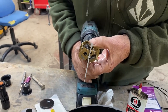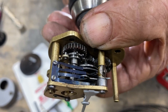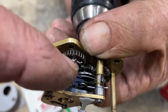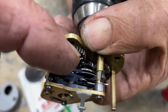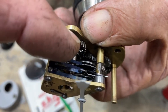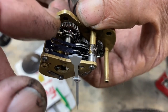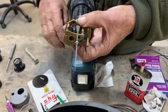Apparently this is the way the thing is supposed to work, roughly. We do know that the components on the inside of this mechanism are simply no longer available. There's a little cam that operates these metal strips here and causes the needle to go in different positions. Inside this gear there is a little spring that causes this ratcheting pawl mechanism to come down to the zero point, which it does arrive at after all is said and done. Apparently the spring in there is no longer available — it's weak. But it is operating and making the needle move in a very tachymetric fashion.